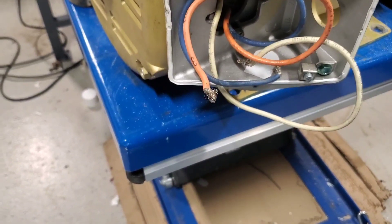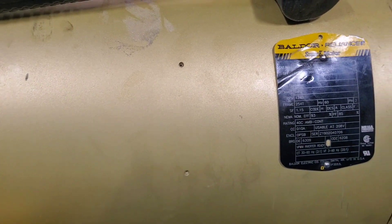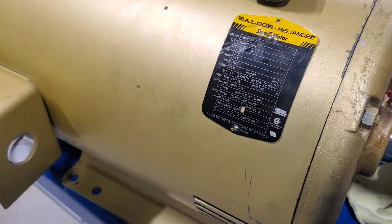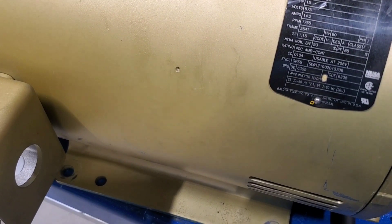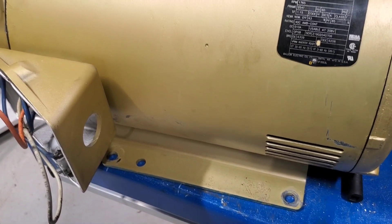Some of my apprentices have asked me about rebearing squirrel cage motors. I think this is classed as a squirrel cage, and this one happens to be an OFDP — open frame drip proof — because it has an open frame and it's drip proof. If it was TEFC, it'd be totally enclosed fan cooled, but this is not. Anyway, thanks for tuning in on how to rebear an electric motor — a very simple job that can be done with hand tools. You don't need an induction heater; you don't really need a press. For smaller frame motors you can drive them on with a drift and hammer — not preferred, but it'll get you out of a bind. Have a great day.